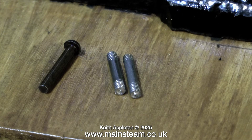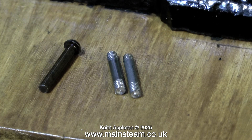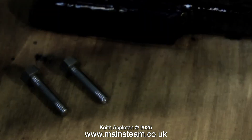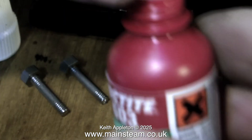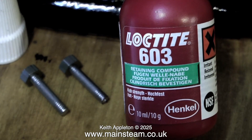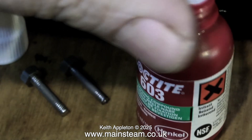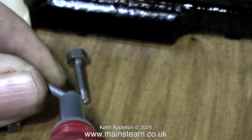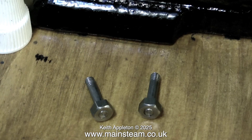These pins are one eighth of an inch in diameter with a 4BA thread at each end — a tight 4BA thread, because I don't want them to be a rattle fit. Although one of the nuts is actually going to be fastened on with some Loctite 603. The other thing I'm also going to have to do is machine the nuts to be a smaller thickness. There isn't much room at all between the two bars that pull the expansion link back and forth, and leaving the nuts standard size will just make them foul the bars.